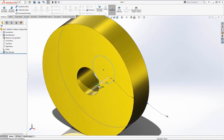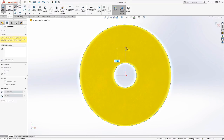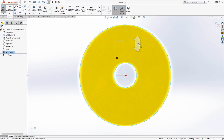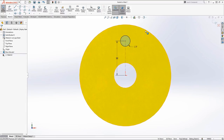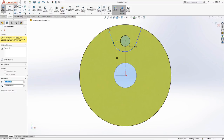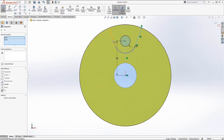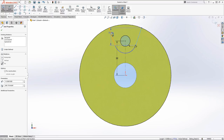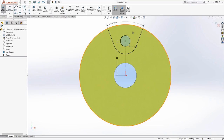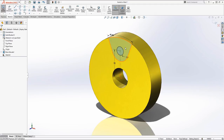Next, we're going to create a sketch on that front plane. I'll use a construction line here, 22 millimeters, because the bolt circle is 44, and we'll draw a 7-millimeter circle to define the hole, and I'm going to convert that outer edge. That'll help me when establishing relationships while sketching, so this perpendicularity helps establish that relationship. Transitioning straight to an arc right off the line command, then we'll add a concentric relationship. I'll also add a symmetric relationship between the two vertical edges, then add our 45-degree dimension. The radius on that lower arc isn't needed because of that perpendicularity — the line goes through the center.